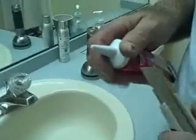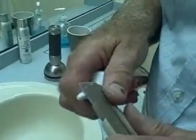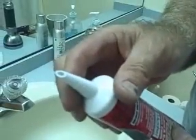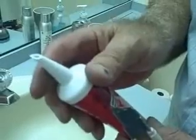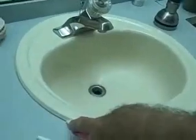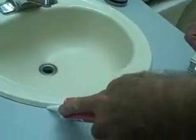The other thing we're going to do is cut our opening on it, and we don't want real big ones, so we cut a 45-degree angle, so that when we put the caulk on, it flows on nicely. The other thing we do is square off the top and make like a shoe out of it, because when we go around and caulk, it'll actually help put itself in. I'll show you that here in a second.